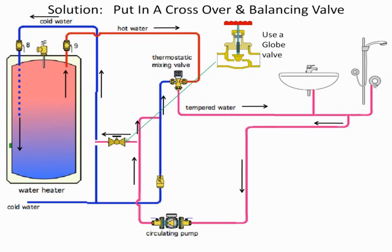I don't want to have a full open or full close. I had one particular installation where the engineer made the mistake, specified a quarter-turn ball valve. The contractor learned in his apprenticeship training a ball valve has two positions, open or close. I got to the project, and the contractor had it in a full open position, doing what contractors are trained to do. In that particular case, I laid blame on the engineer for specifying the wrong valve. Engineer came to me and said, well, that's the valve the manufacturer told us to put in. And I said, well, the manufacturer was wrong then. I actually spoke to the manufacturer, and they said, well, we thought you can only use full open valves in any of the piping system. That's not true. This is a valve that is a controlling valve. So you've got to be very careful with this.